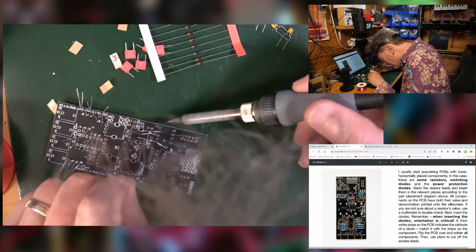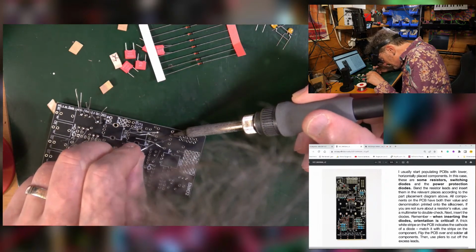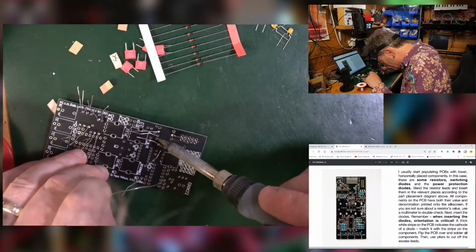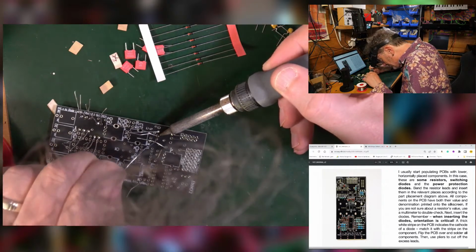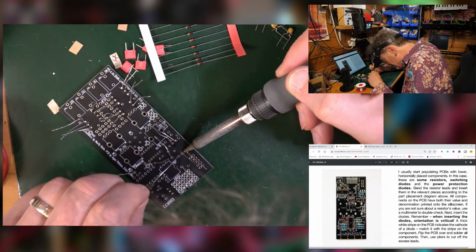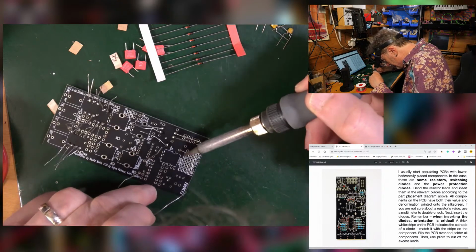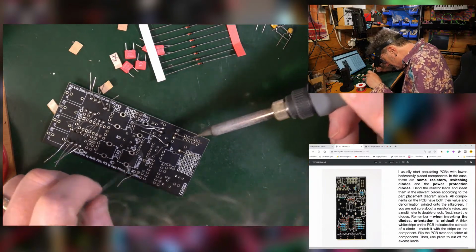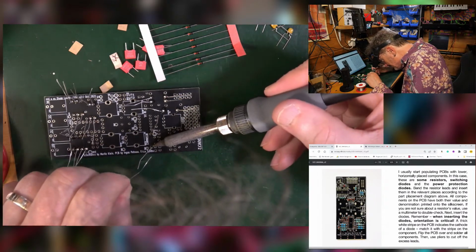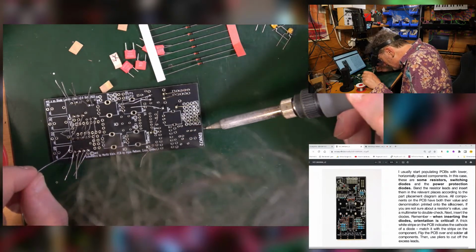It's just the most beautiful soldering. See, it's interesting. I just got a splash of solder onto my thumb. And it's always a reminder to myself that it's really good to wear safety specs, because every now and again a piece of solder will just spit. And it would be devastating if it hit you in the eye. Okay, good.